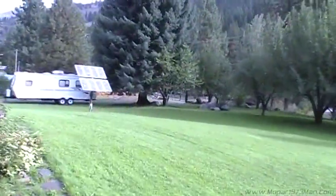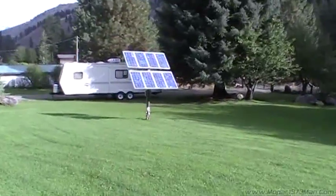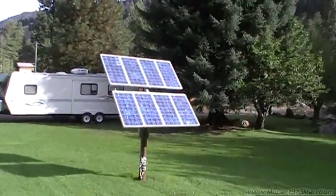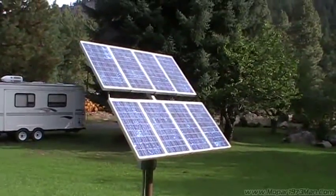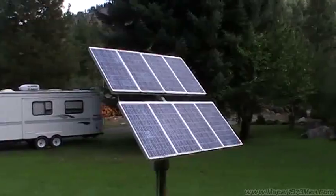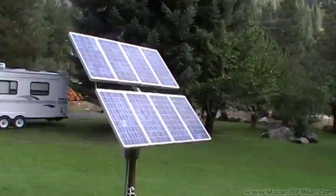So now if we go ahead and look at what I've got producing. Here's one of my productions — nice sunny morning. There's 400 watts of solar. It's kind of cloudy and overcast right now, but I'm getting a little bit of production for that moment. So there's 50 watts per panel, 400 watts total.